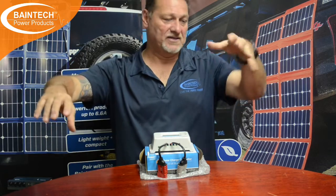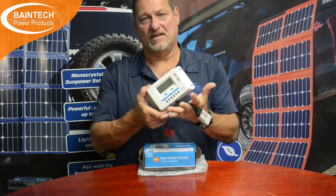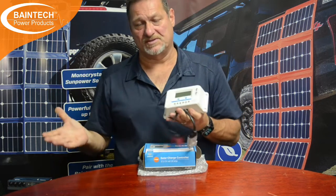So that's why we recommend that if ever you're going to put a portable or an external solar array into your fixed system in your van, have a separate solar controller that you can still have wired permanently in the van, but just have its own connection going out and its own connection then going to the battery charging system. Or you can just have an Anderson plug that goes directly to the battery and use an external controller that comes with some of the portable devices, as long as you plug that in between the solar and the van.